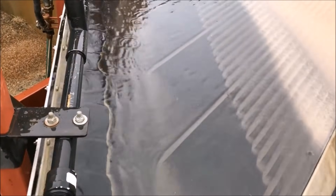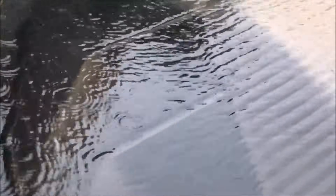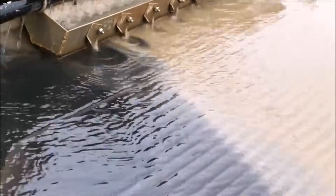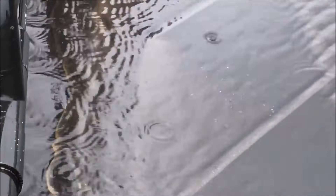You're starting to see a little gold line form on the shaker table, and it forms right underneath that water bar on the cleaning plane. As we pan up the shaker table you can see the first long groove that captures almost all the gold as well as the sulfides, and brings it out onto the cleaning plane where the water bar washes the sulfides back down into the number two and number three port. Working our way down, the gold line becomes much more apparent.